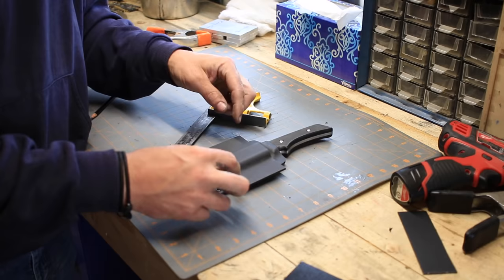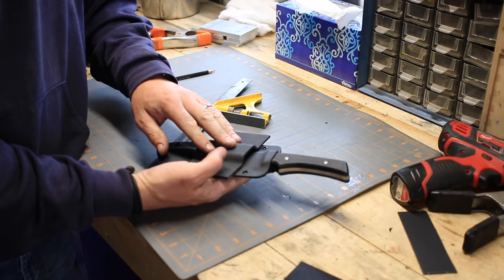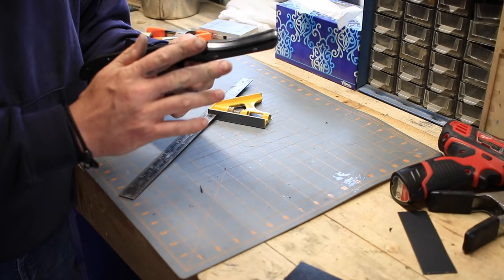Put our clip on, and I don't finish polishing everything up until this is all done, because as you see, I'm gonna have to cut all the material off of this stanchion, this little riser that we made. But we'll get all that cut off and mount the clip, then we can test it on the belt, make sure it functions correctly. And if it does, I usually take a little sandpaper and a buffing wheel to the edges to get them nice and shiny, give it more of a factory look.